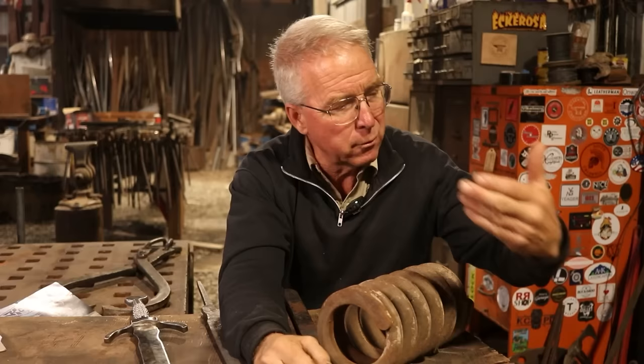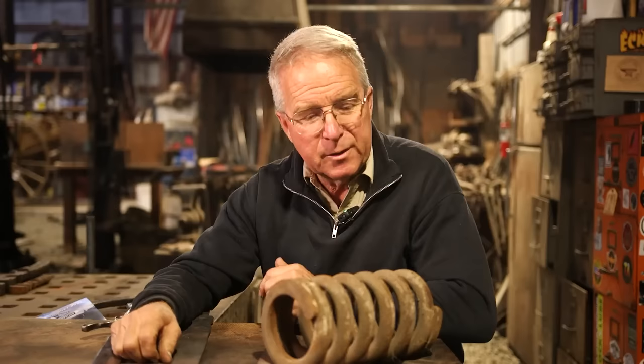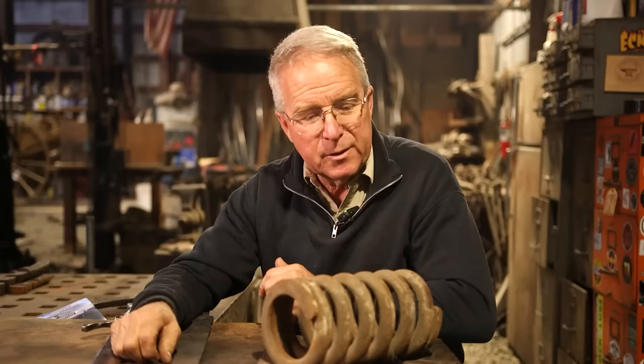The downside is you should not switch back and forth from grinding steel with your nice ceramic belt to grinding any kind of an oily wood — like a rosewood or an ironwood, something that's oily and finishes up real nice. Because that oil will glaze over those little ceramic particles, cover them up, and you just wreck the belt. So use an aluminum oxide belt for that.